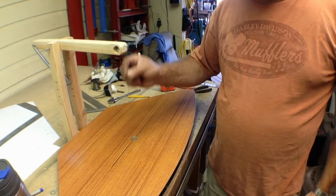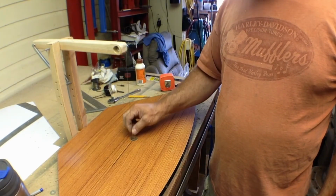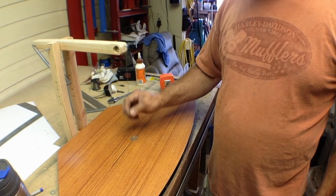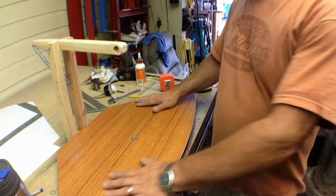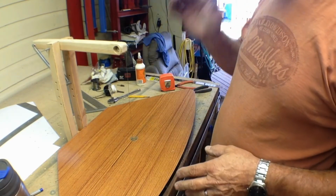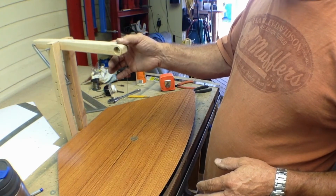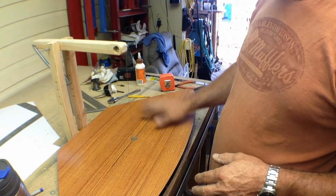Well, here's the mechanical part of it done. Once we heat this nichrome the first time, it will tend to stretch just a little bit and it'll straighten out hopefully. But this is the mechanicals of it. We're relatively straight up and down. We can make a little bit of fine adjustments by doing bolt tension and that kind of thing. We're spring loaded, so we'll hold tension on our wire the way we want it to.